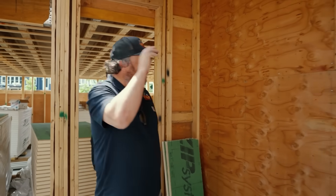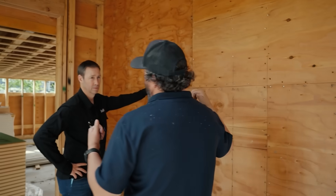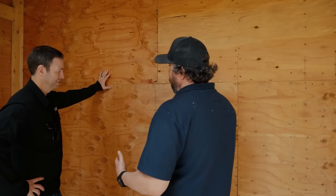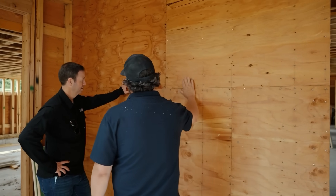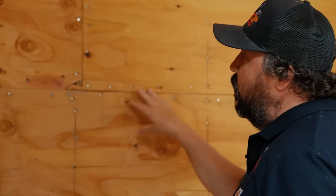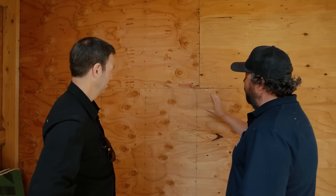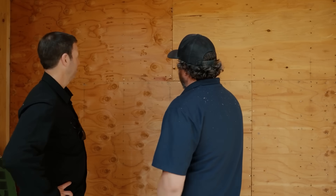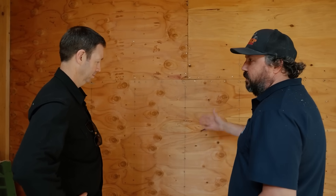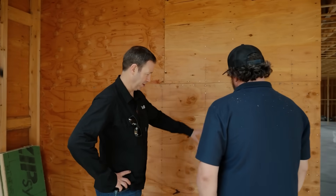Before we hop in the house, take a quick peek at this — this is all part of our shear wall system that wraps around the corner of the garage. Because we have so much glass, windows, and doors here to take in those water views, the structural engineer wasn't left with a lot of exterior wall space to have shear. So a lot of the exterior walls where there's not an opening are shear. Here's a great example of the exterior side of a shear wall with that CDX — and these nails aren't randomly placed. This is all by design from the structural engineer: horizontally and vertically, here's the type of nail, the length, the gauge, and the spacing. The framer paid attention not to blow these nails halfway through the CDX — they're just breaking the surface. And he even chalk-lined where the studs were to make sure he was absolutely hitting them.